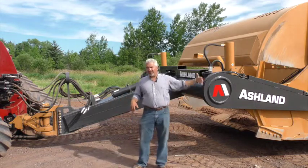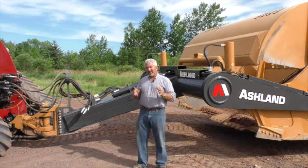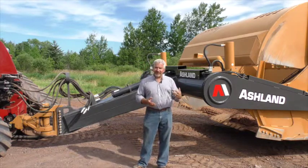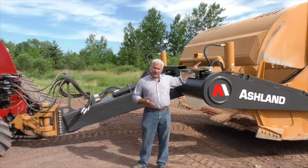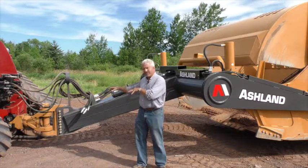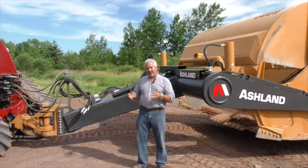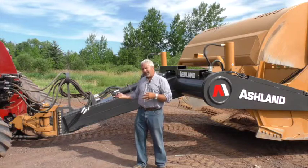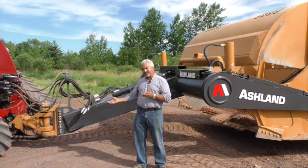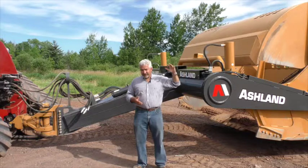What you're seeing in the market today is a lot more companies — including us, John Deere, and several others — that are front load designs. We're raising the blade at the front, so you can actually put negative weight transfers on the hitch pin. We were finding on some of those Reynolds Quick Hitches with that little swinging tab, we were breaking pins and letting the machine actually separate because we could raise the back end of the tractor up.